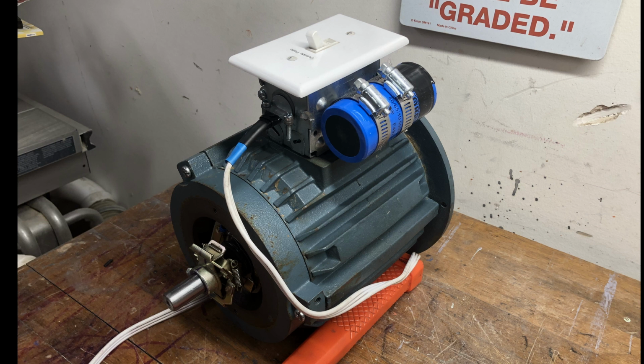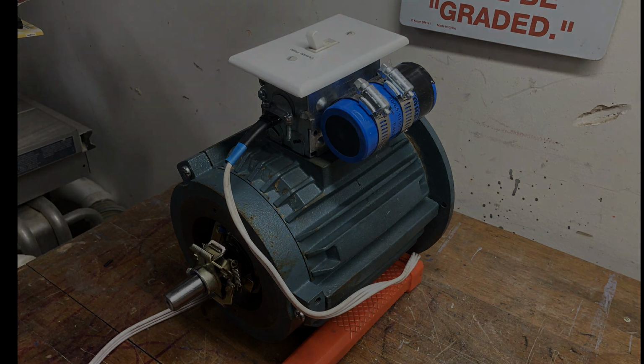So at the end of this video, I'm putting an explanation of how I figured out the wiring for this. My main confusion was why the motor wasn't turning, and I ended up using a multimeter to figure out how the motor was wound, and it seemed to me that there were 3 coils, 2 run coils and an extra start coil. I also figured out how the capacitor connected up through the switch, and once I got done with this mental exercise, I actually understood pretty well how the thing is wired and how it works. I also watched a couple YouTube videos on how induction motors work.